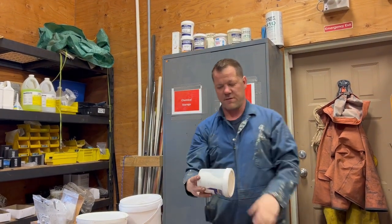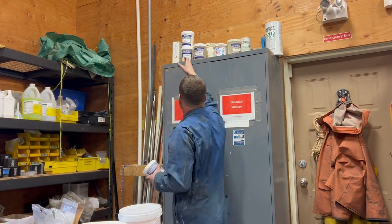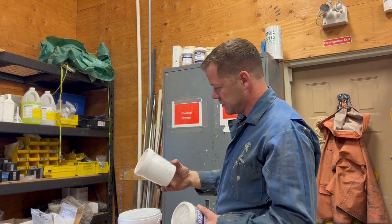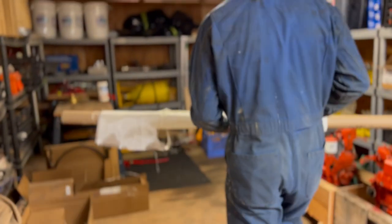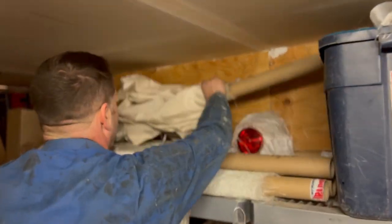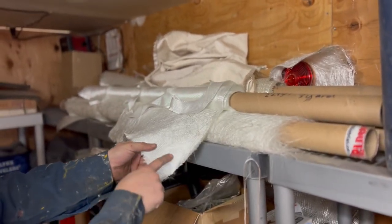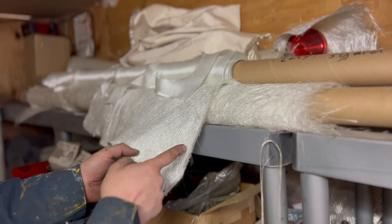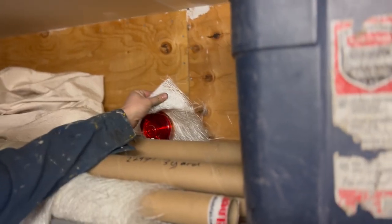This is fiberglass that's just been milled. Mini fibers are the next step up — they're a little bit longer for strength, but that doesn't look like mini fibers at all. We're going to use the cloth. Another product you can use is called biax. You can use biax with epoxy, but if you're doing polyester resin it's different. Biax is a chop strand with a woven backing, but they don't use starch to hold it together. It's the styrene in polyester resin that breaks down chop strand mat.